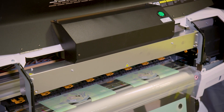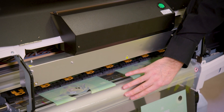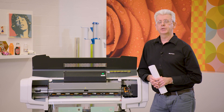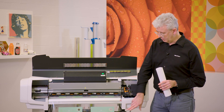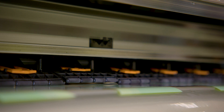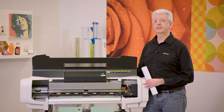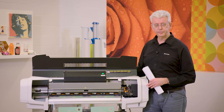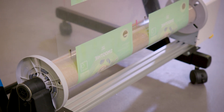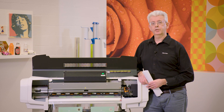The air knife system together with the contact heaters can generate warmth up to 45 to 50 degrees. The media loading system in this printer has been optimized to load a wide variety of flexible substrates, for example this very thin shrink film. The pressure rollers holding the substrate against the grid roller can be individually disabled. At the back of the printer we have the media scroller and scroller receivers that take media rolls up to 10 kg. On the front of the printer there is a 10 kg automatic winder system. The printer also integrates an automatic sheet-off mechanism to allow you to cut off individual sheets and to work from roll to cut sheet.